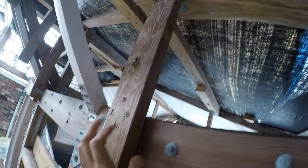All right, here's how it is attached to the rafter. Then the rafter from the 4x4 turns into a 2x4. So this is a 4x4, a short one that holds it up to the former aluminum cage. So this, we're entering this lanai, which is a pool cage. So I worked in the lanai pool cage members. I reinforced everything. There is wood on both sides. Every member pretty much is reinforced.